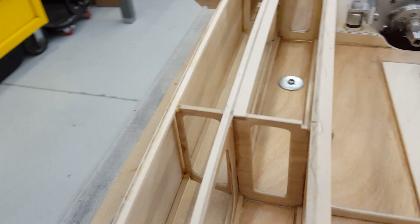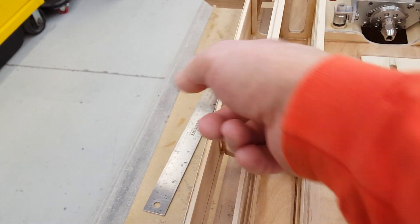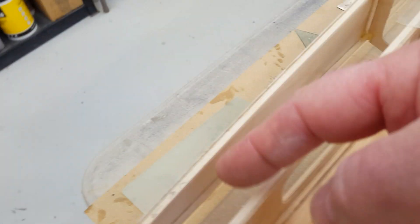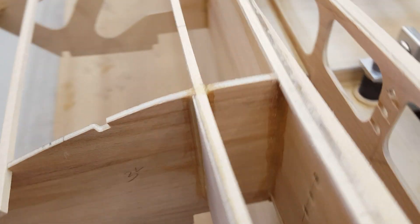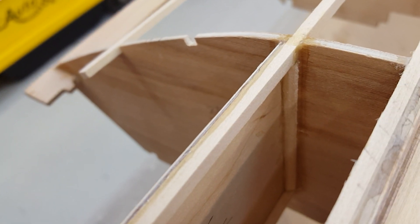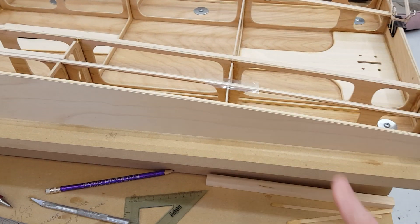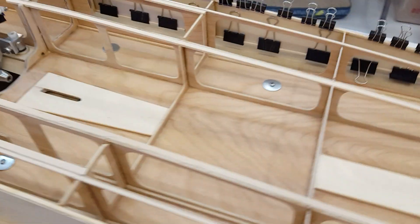Don't epoxy to it. There is epoxy there but that's only because I sealed the end of the bulkhead and sealed that area on the wood, just getting that pre-done. Leave that gap. Back here at the end we're finishing that off solidly, and up in the front as well - just a little fillet there and it's got a 1/8 inch reinforcement rib back behind there. That way this will stay nice and straight for the life of the boat.